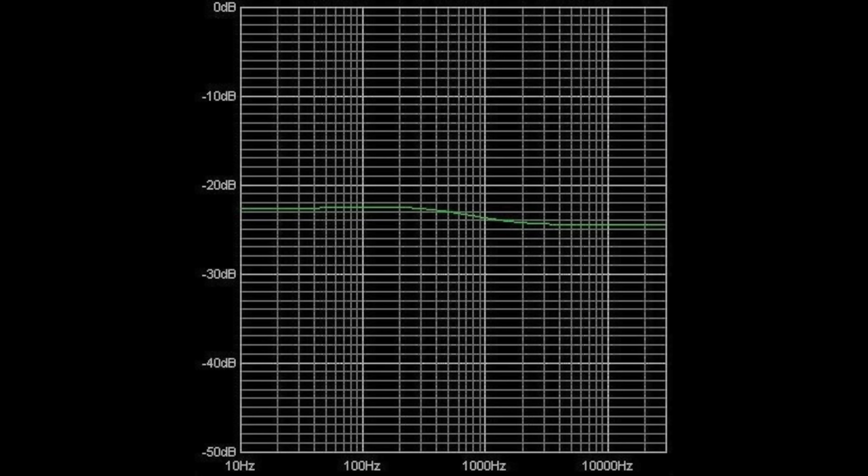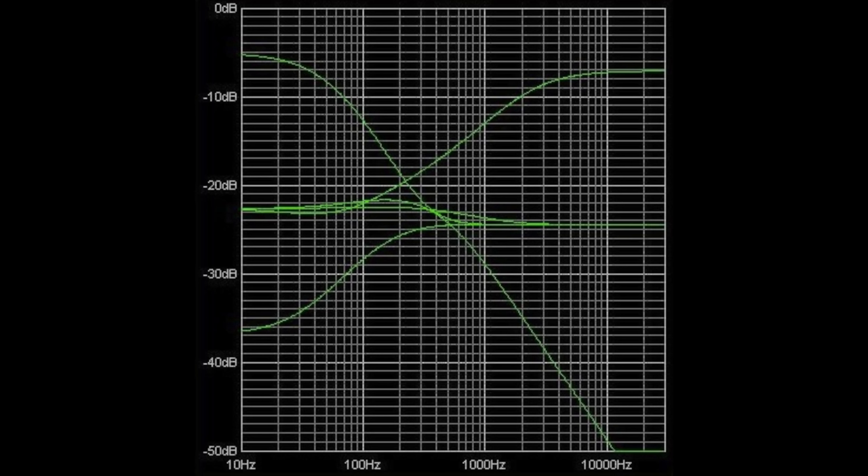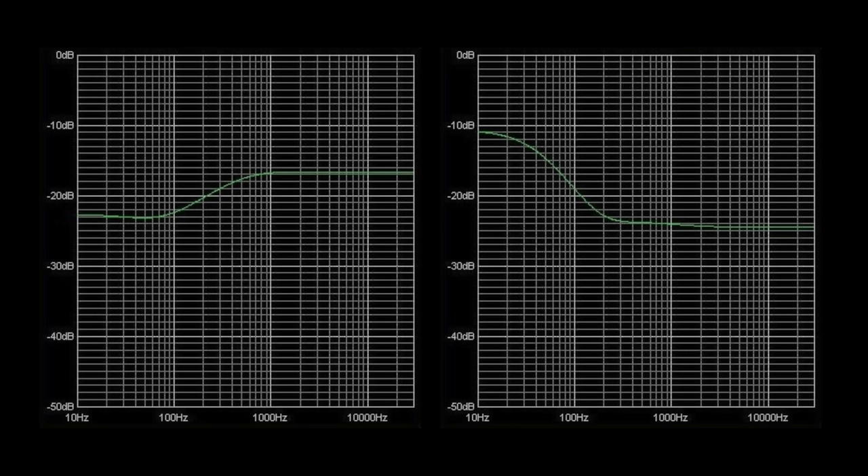If you're curious about the James Tone Stack, when you go to the Arkham website there is a link that takes you to a whole separate page giving you the rundown on what the James Tone Stack is. Despite its simple two-knob form, the James Tone Stack offers several advantages over other tone circuits. One is a nearly flat response when bass and treble are set at 12 o'clock. Sweeping both controls, you can see the wide adjustment range and limited interaction of treble and bass. Like any passive EQ, these controls simply decrease the amount of attenuation in a given frequency range, providing an apparent boost. The left plot is the treble knob at 75% or 3 o'clock; the right plot is the bass knob at the same setting.